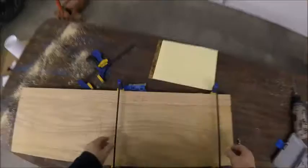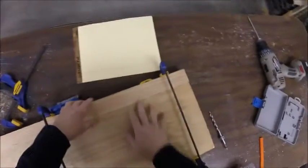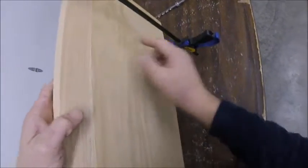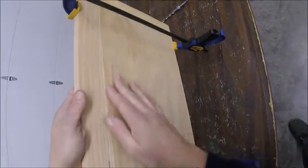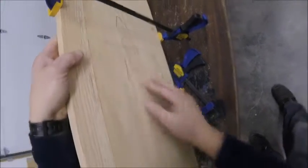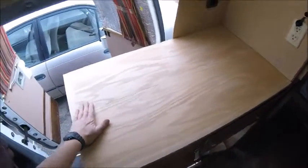I've taken the two pieces — this is the solid piece and this is the oak plywood — and I've used these quick-grip clamps to join the two pieces together to where I could sand it down, put wood filler in, and get a really easy sand-match on the texture. I've got these all lined up. What I'm going to do next is come in and join these two pieces, then do the same to join the other piece that goes toward the back.